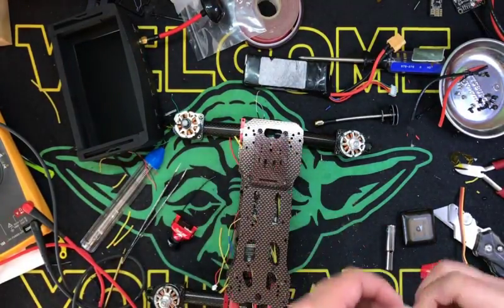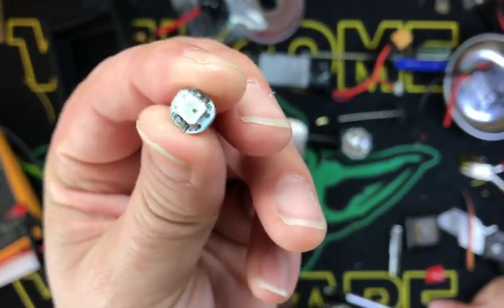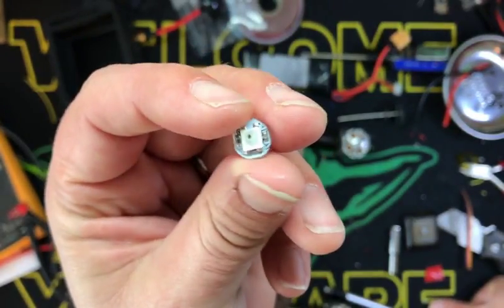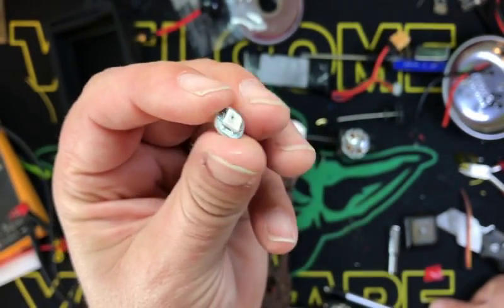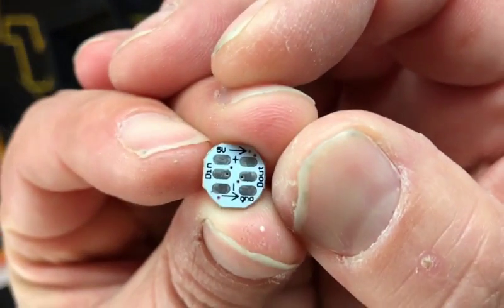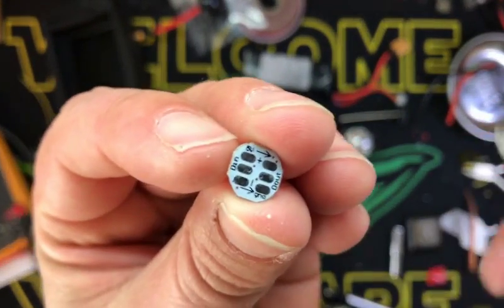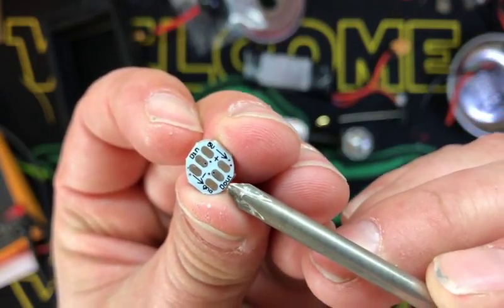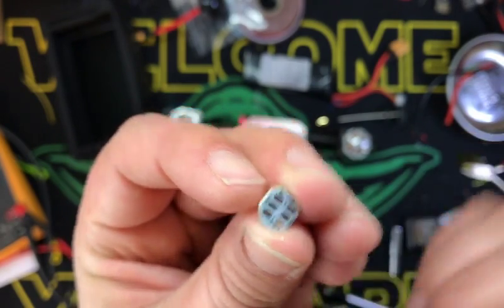The one thing I do like to know is if I've got GPS signal. So when we first plug it in, this will blink red, and then when it starts acquiring satellites, it'll go blue and flash. And then once it has satellites, it goes green. So we're going to go ahead and put one of these ends — very, very simple. See where it says five volts, ground and signal in, signal out. All we're going to do is put three wires: five volts, ground, and signal in.